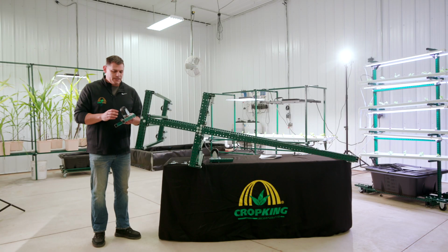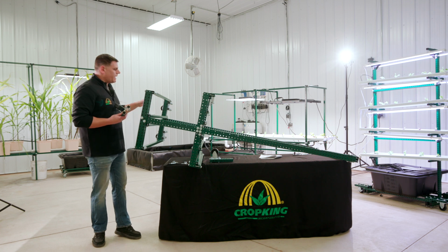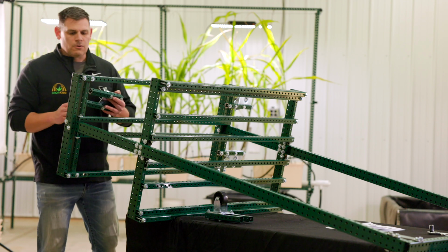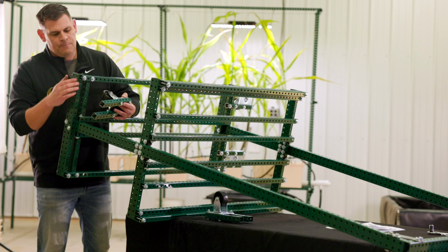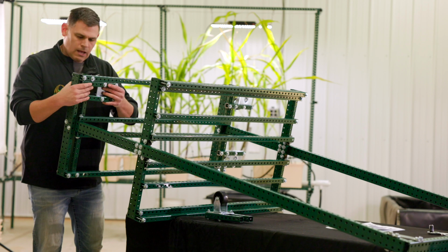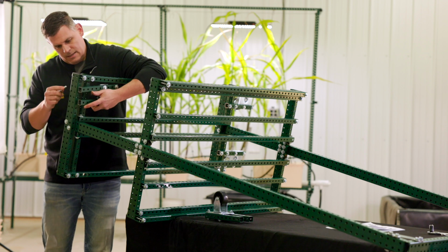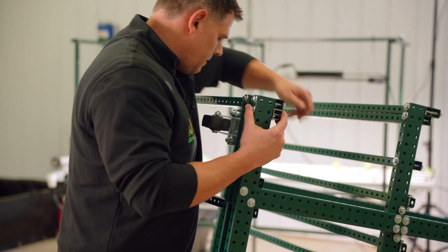Our final installation is our rigid casters. These are going to be oriented slightly different than the swivel casters that we just put in place. In this case, our rigid casters are actually going to go now to the inside of the unit. So the same alignment is going to take place. We're going to align hole number 1 with this outer piece of 2-inch tube steel or rectangular steel. We'll take a washer and a bolt and come up through the bottom and through hole number 1 to secure the piece of framing.